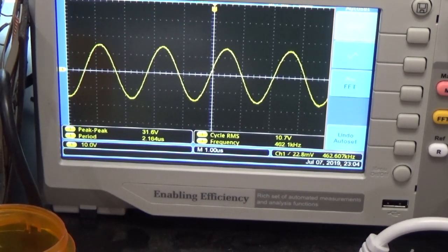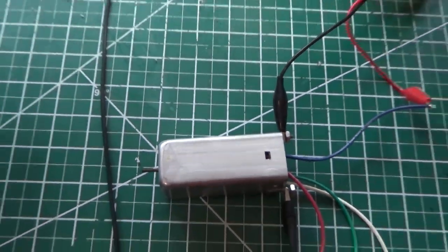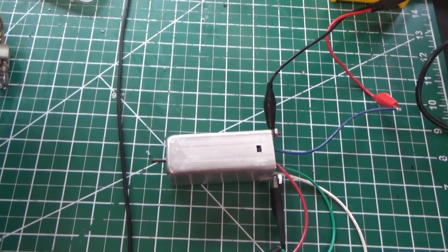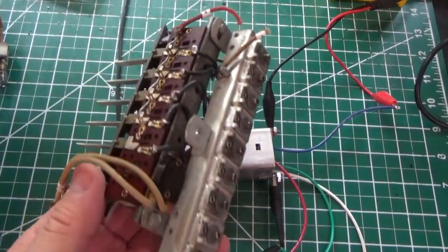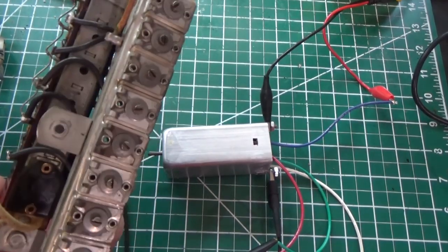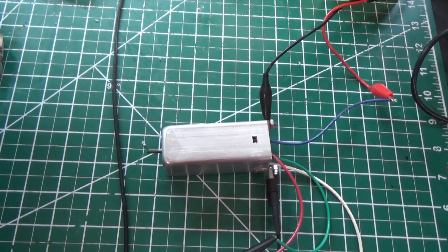We will come back in the next episode with this can installed in the radio, and we are going to do our first power up. First thing I have to do is I have to get this push button switch installed in the radio because that's where the power comes from. So I have to install the bracket that holds it in. I've got to de-rust that and clean it, and you'll see that in the next episode. It'll all be connected to the chassis.